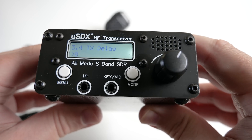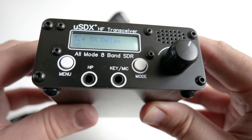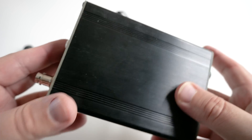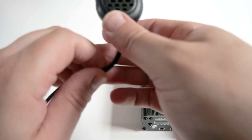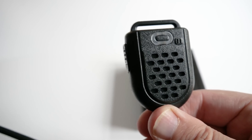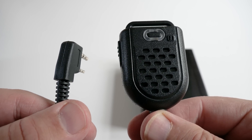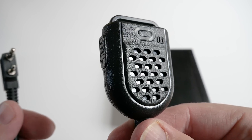The specified output power is between 3 and 5 watts, and I guess that's depending on whether you're running from the internal battery or from a 13.8 volt supply. Later in this video I will demonstrate the exact RF power output on each band from running with battery or an external supply, so keep watching.